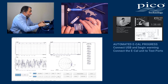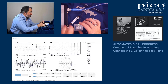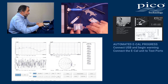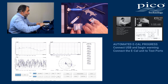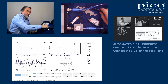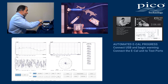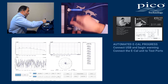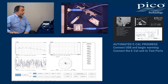So that is now warming up for us. Let's begin the connection — it's already ready for us to use. I'm connecting port A of the device to port one of the VNA and port B to port two. That's going to be important — we'll need to remember that as we go through the calibration process. The device is warmed and ready to use.